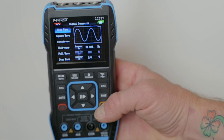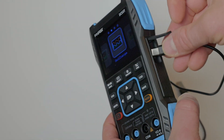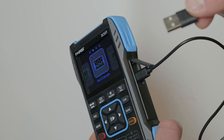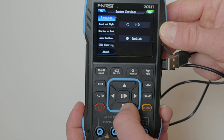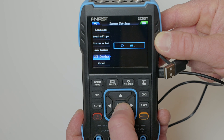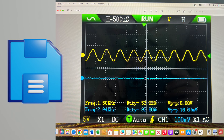We'll go ahead and stop the wave. To get back to the main menu, just hold down the menu button. This is your charging port — you'll plug in the USB-C cable on that side, which can go into either a wall USB or your computer. If you have it plugged into your computer, you can go into the settings menu, scroll down to USB sharing, and turn it on. With it connected, you can share the files you saved with the save button — that way you can view your o-scope waveforms on a bigger screen or share them with other technicians.